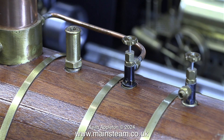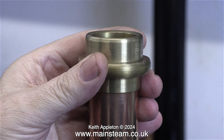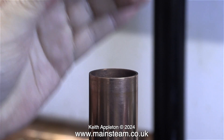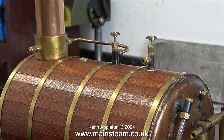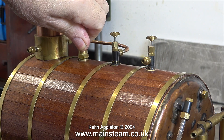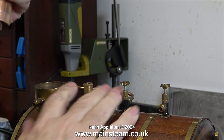What you're about to see is a little bit scary. This is a chimney cap that was made by the owner of the boiler — it didn't come with the boiler when he bought it. I've been mentioning scale a few times in recent videos, and this is a great example of how not to do it. This is so radically overscale it looks incredibly wrong. I removed it and put it somewhere where I couldn't see it. In the next episode I will remachine this to a reasonable size. I may be being over-critical, but I do not like this safety valve either — I'm going to replace it with a Jubilee Fittings safety valve, as I much prefer them. The Jubilee Fittings safety valves are pop safety valves — they pop open for a while to release pressure and then snap shut after the pressure has dropped by a small amount.